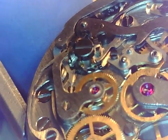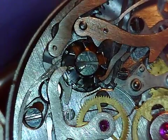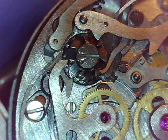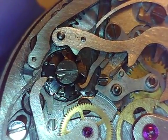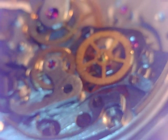actually there is the shot not in focus. Let's do this to show you where that lever sat, or that lever, good lord, to show you where that spring is settled. When I actuate the reset lever, see that pin? It's sitting right on that pin. And I'm going to put a, there you go, there it's actuating. I'm going to put a smear of 8200 on that pin and lever assembly, because it's going to need it.